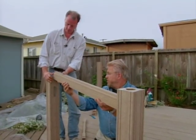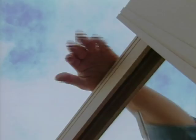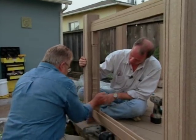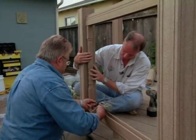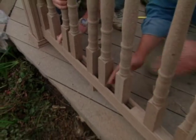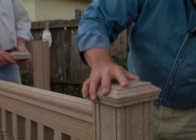We install the universal rail bottom side up for the top rail and secure it in place with screws going up through the rail. We attach the end balusters with a long screw. Then we simply slide the other balusters between the railings and use spacers to give us a consistent distance between each one. Finally, we put a few dollops of silicone on top of each post and set the decorative post caps in place.